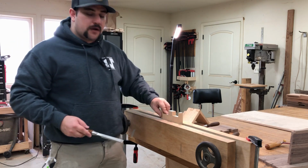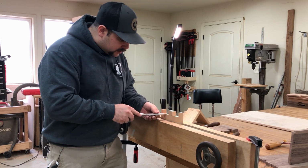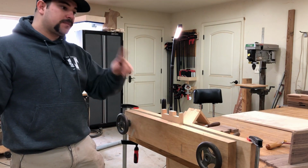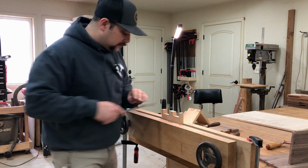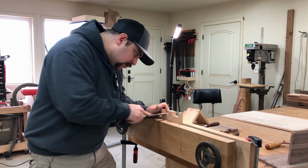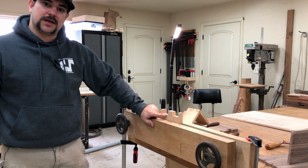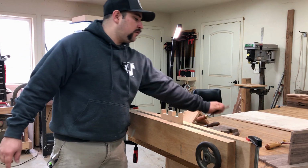And that's pretty good. For this hump, what I'm going to do is put part of the chisel in that baseline and work back like this. This hump's not super severe, but what I want to avoid is accidentally losing control, coming back like that and taking out a big chunk. So one trick that you can do is use that wood file, because this isn't a super severe hump. I could just give it a few strokes, and that's pretty flat now. A little bit in the back, and that looks really, really good. Obviously where I put that nick in from the chisel isn't going to look great, but that's one of the areas where you can use that wood file.